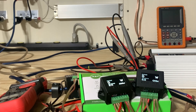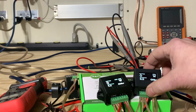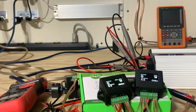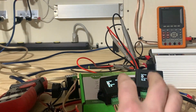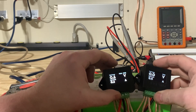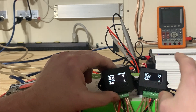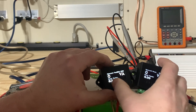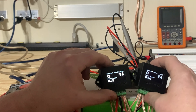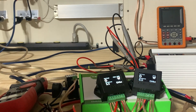On startup you really can't tell a difference, but when you put them on peak hold, version one shows 'peak mode' and version two only shows 'peak' on the screen in the corner. They both have the same screens. It's already showing 0.6 volts and 0.3 amps current on version one and nothing on version two. You can see the power factor is already reading incorrectly on version one.